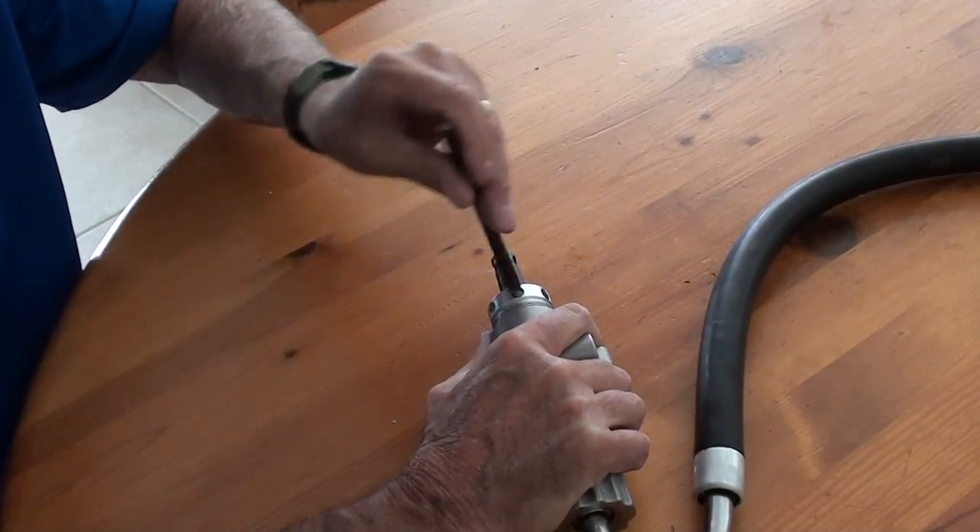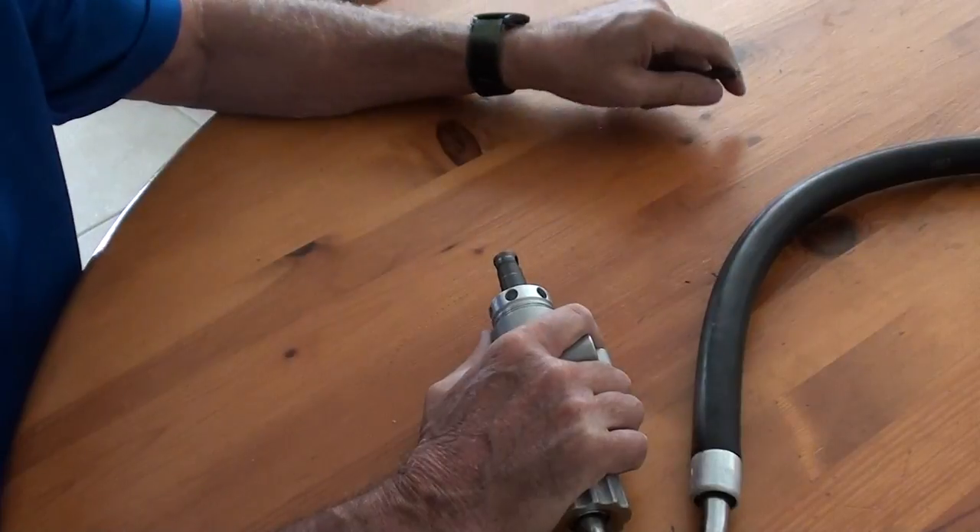Thank you for watching our video on the SureStrike 3650 Line Striper. Make sure you read and understand all the instructions and warnings in the instruction manual. A clean machine is going to work next time. When you store the machine over winter, use a 50/50 mix of oil and paint thinner — just a thin oil in the machine stops anything from sticking and won't freeze.